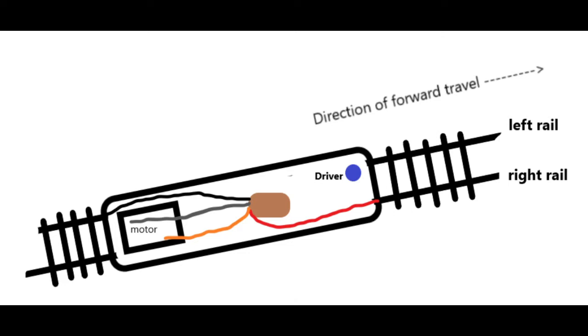The orange wire connects the decoder's motor drive output to one of the motor brushes, and normally this would be the right hand or top motor brush. The grey wire also connects the decoder's other motor drive output to the second motor brush, and normally this is the left hand or bottom brush. If the loco runs backwards when wired up, swap the orange and grey wires — which means desoldering and resoldering — or you could change the value of CV29 to make the loco run the other way.